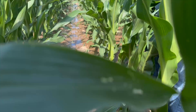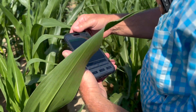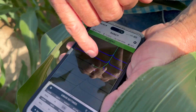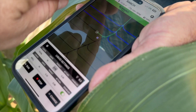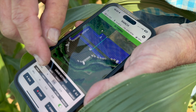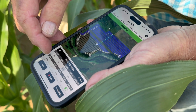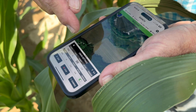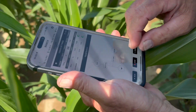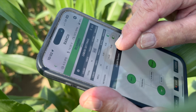Turn the app on here — we'll see if we can show everyone. With new technology it can be a little scary, but the good part is the connectivity. We're on the blue dot where we're standing and it's heading west now. You've got speed, RPM, how much fuel's in the machine, and what you're putting on — we can see the whole field. Right now we're applying point three six, just a touch over point three five. We're looking for nitrogen — how much are we actually putting out? My goal is to put on 14 gallons to the acre, and right now it's running about 15, 14.4, 13 — it averages right at 14.